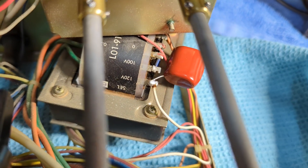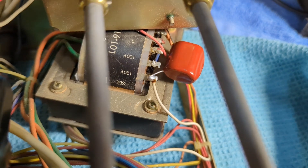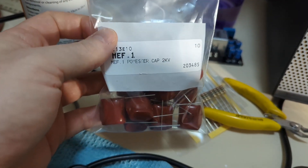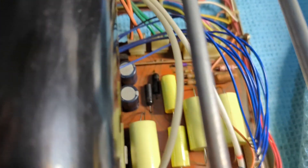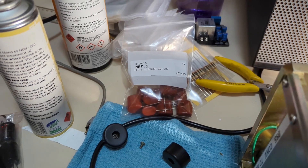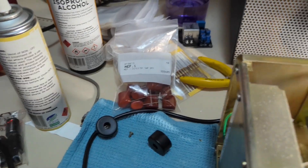I was also able to replace that oil-filled bypass capacitor with a nice polyester cap. Thankfully Wagner and Wes Electronics actually has these in stock. Probably could have used those in the high voltage section as well. Not very easy to find - I did a little bit of digging on the website through various types to find those, but I'm glad to know that we have these as it'll make it easier to fix up similar situations.